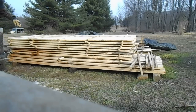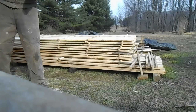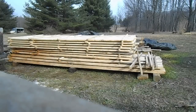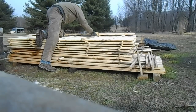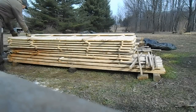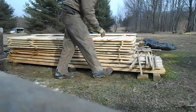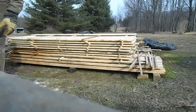I've got them all the way down, every foot and a half apart and about three inches from each end. Now I'm going to place my next boards on top of the pile — these are real nice boards, about thirteen and a half inches wide and seven-eighths thick. The reason we went to seven-eighths is because we're going to plane them down for bee boxes — it saves a lot of planer time. You only have to take off an eighth inch instead of a quarter.